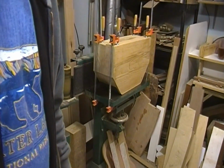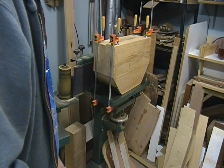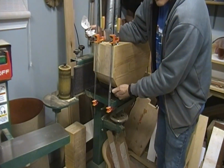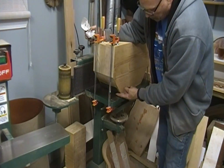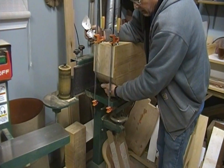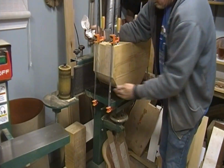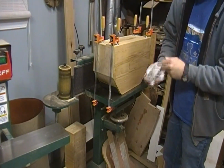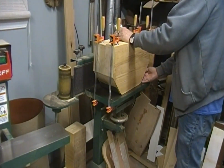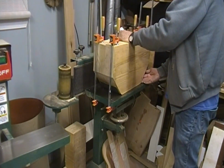All right, so I've got that thing clamped down to the flat bench. What do you want to call it? Sander table. And actually, as the spray adhesive has dried, I've just come in here and pushed up on the little bubble, which probably wouldn't have affected me anyway, as long as it's tight around the corner. But I just wanted to make sure that it was snug around that radius. And it feels like everything's pushing up and staying glued down there. So that's good. If that becomes a problem, I can actually just staple it down around the ends because it's not really going to come in contact with the belt there. Yeah, this one feels good as well.